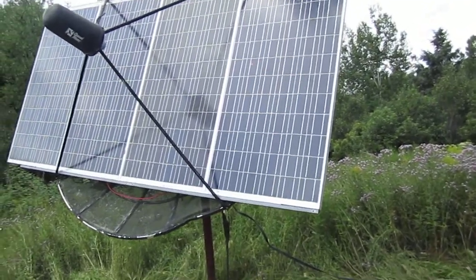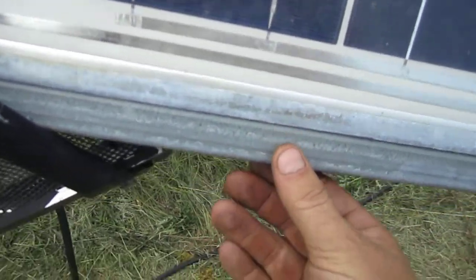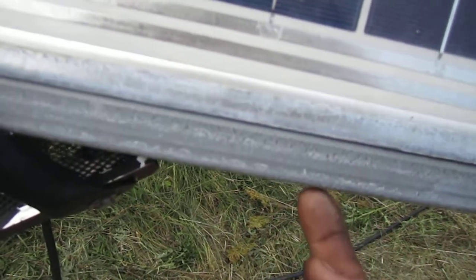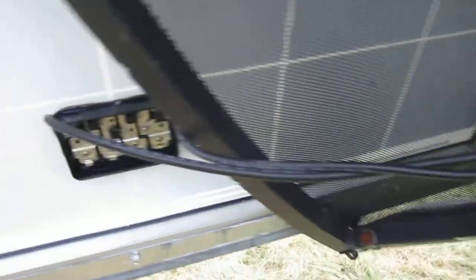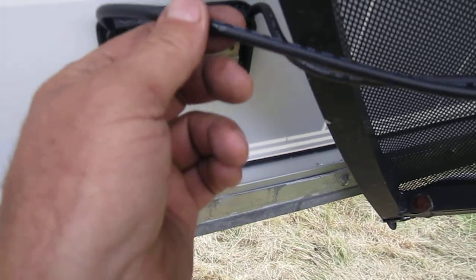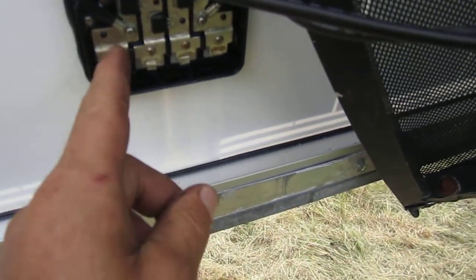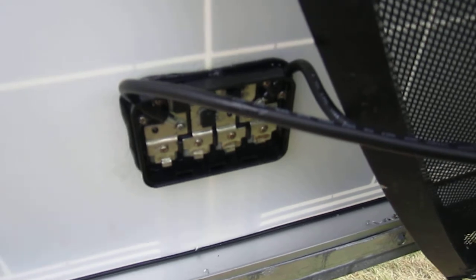I made a frame up for the panels themselves to get them all close together. It's basically a cap that caps the panels, all bolted together, and to give it extra strength I bolted it down to a one by two inch galvanized, one-eighth of an inch thick. These panels never came with caps, so I put some rust preventive oil on here to keep the moisture out.